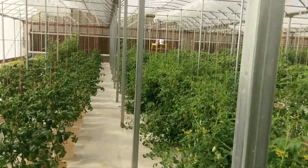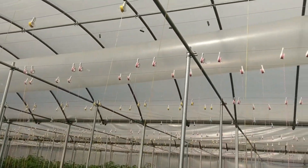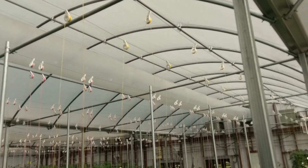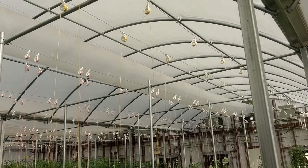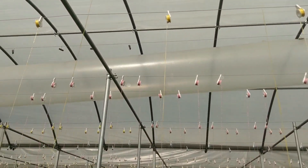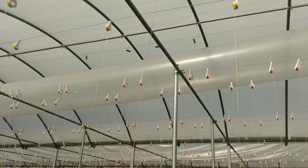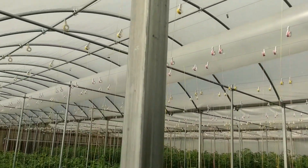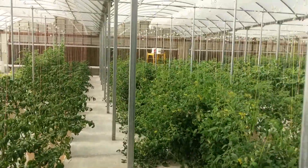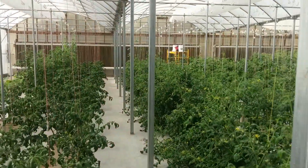You can see the scaffold in the back. I was working on the jet fan tube up here — this thing circulates air. Somehow it just ripped open toward the fan, and I had to pull it down and turn it around, because I can't afford one of these new ones right now. Ain't no telling what that thing costs — probably $200. But those little clips, the plastic is kind of flimsy up there, and it gets a lot of use and it rips out the plastic. It's probably two, three mil plastic, and it doesn't hold up a whole lot. Although, the two original ones over there must have been built a little better, because they've been going for four years. These only made it about two.